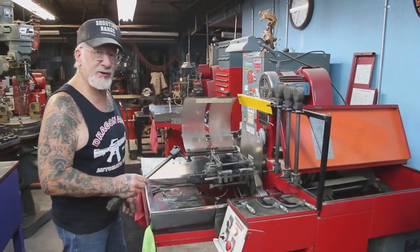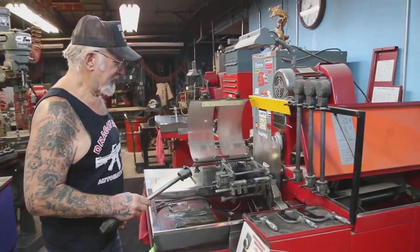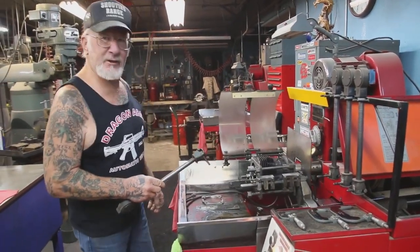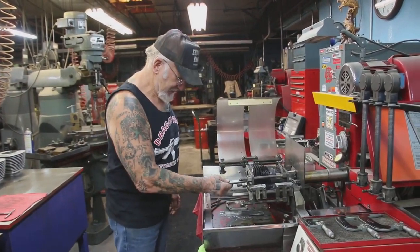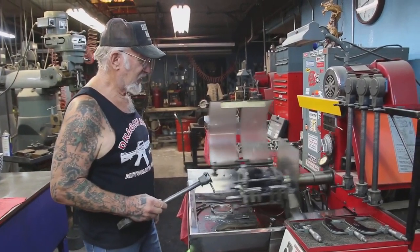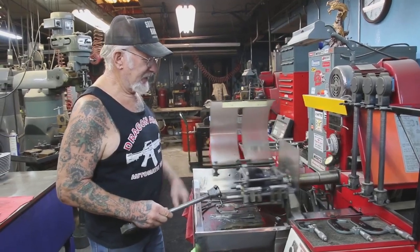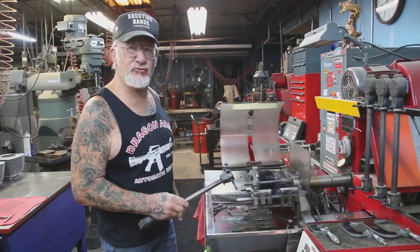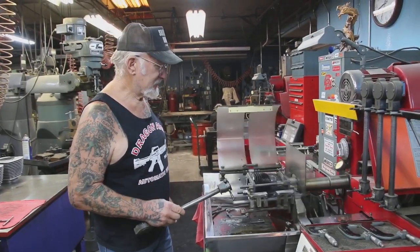Normally when a guy comes in with a set of cylinders, I just tell him to hang out for 15 minutes. What bike shop in the country is going to give you service like that? Okay, just a little more. And then we take it to my other honing machine and we give it a fine 300 crosshatch. That makes the cast ring seat right away.